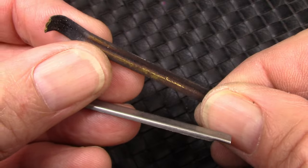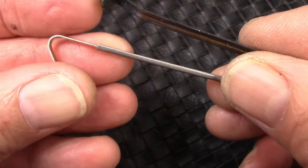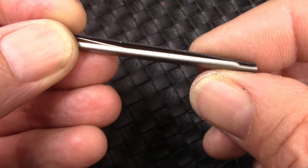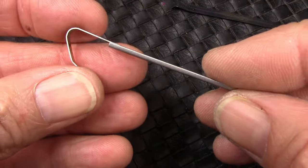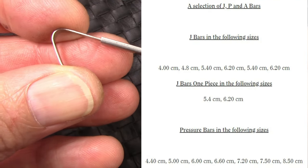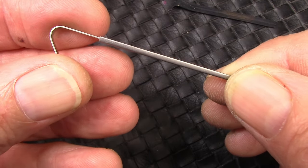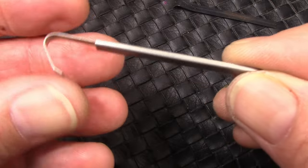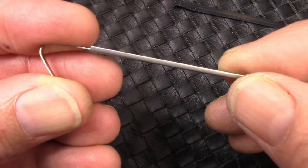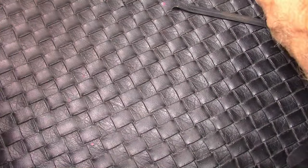We know the J-bar needs replacing — not functional the way it is. I said I had them, and here's one that appears to be the right length: 62 millimeters. They come in a variety of lengths. Anderson Pens has them, Pen Tooling has them — I'll put some links to places to buy them if you're in need of a J-bar. This one will slide into the barrel — I'll make certain we line it up with the lever, but that's something I'll do a little bit later.